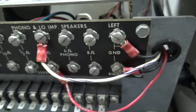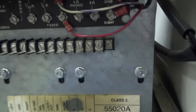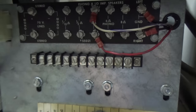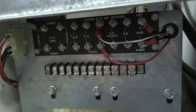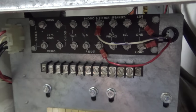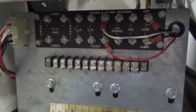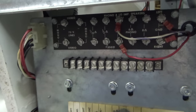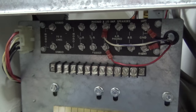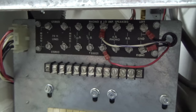But I think whenever they did it, they probably reversed the wires. That's why we've got the left one working whenever the left channel is dead on the top. You can move these and change the power going to the speakers, and you can also add external speakers — so you can have 10 different speakers playing as long as you're smart about it. All of this is covered in the manual though. So let me remove the amp and let's check it out.